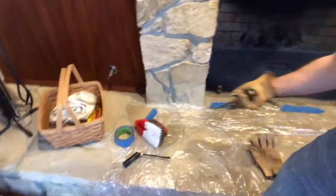What happened was there's some creosote and soot, and we had a little bit of rain and it all gunked up on the corners. When the inspector came by he couldn't open the damper because it's kind of glued shut by soot. So I'm gonna take my trusty screwdriver, clean things out — I've got a brush down here — and we're gonna fix our flue.